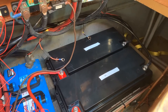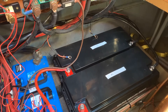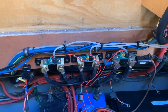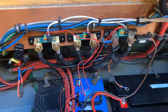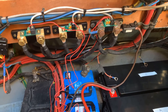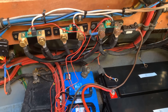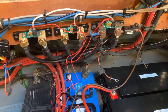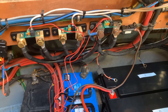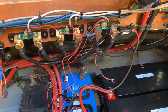Here we are with the final setup then, wired up. There are a couple of loose terminals which I've just got to extend for the heating system on the boat, but essentially the batteries are in. You can currently hear it charging — it's charging off the landline at the moment. No signs of anything going over temperature. We did do a test charge with the alternator and got about 85 amps, running at about 85 degrees centigrade. I just need to do some checks to see whether that's appropriate or running a bit hot, but 85 amps is very similar to what we saw with the lead acids so hopefully it should be running in spec. Going to tidy some of these cables up and charge the lithiums up to full — they're only about 41% at the moment — then reset all the battery monitors and see where we go from there. So far so good.